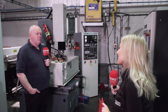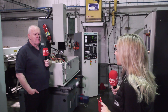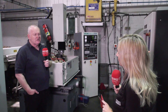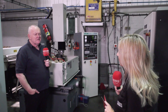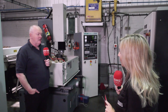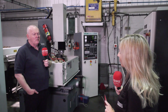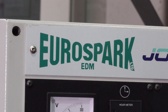So John, the Jomar 322 — what is this machine ultimately doing for you? It's making our life a lot easier. We can just put the electrode in, watch it start up, and then walk away, whereas the EDM machine we had before was a lot older and the toolmaker would have to spend a lot more time by the machine watching and checking it wasn't arcing out. For the budget we had, it ticked all the boxes. Most of our molds are single impression so we don't really need a full CNC EDM machine, and for the money we paid it does everything we need really well, giving the toolmaker time to get on with other more manual work.